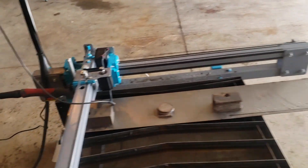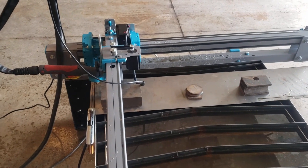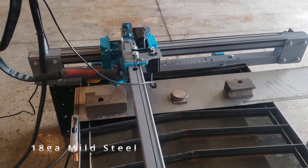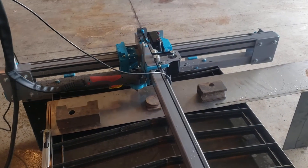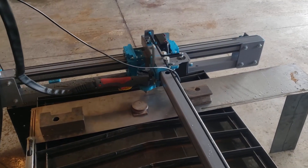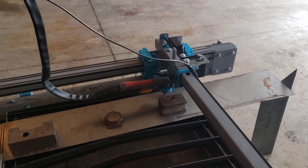Looks like we've got her dialed in pretty good. We've had a bunch of snow this winter and we've ruined the cutting edge on the shovel, so we're going to try and plasma cut a new cutting edge. We've got it loaded in the machine and we're going to have a go. Real thin metal here. The G-code is set to cut out the holes first — we're not sure why it travels to the far end to do the holes and not along the way, but we're just not very skilled at manipulating the G-code yet.